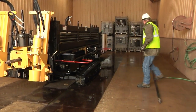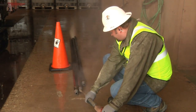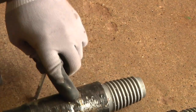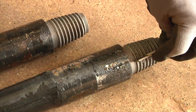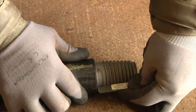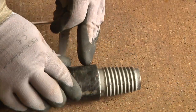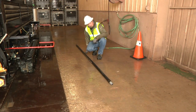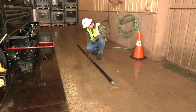Weekly, you should unload all the rods from the basket and flush out all drill rods of dirt that may have accumulated. Examine the threads of each drill rod carefully with thread gauges — are the crowns sharp? Is there thread missing? Are the box end or pin end shoulders rounded or nicked? Remove rods with questionable threads. Use the thread profile gauge to check for thread wear; if the wear is significant, remove the drill rod from the basket. If crowns are peaked, you may be able to file them down. Roll each rod on a flat surface to see if they are bowed. Bowed rods, caused by oversteering, are permanently fatigued — remove them from the rod basket.